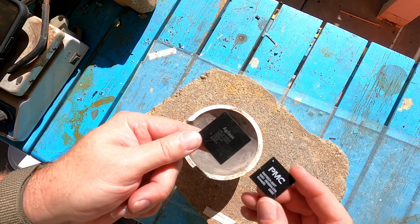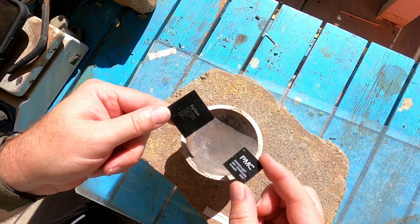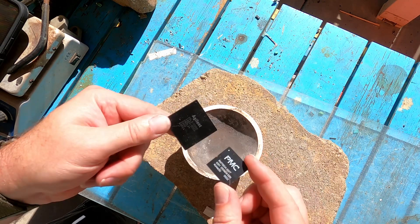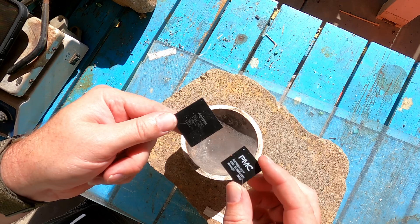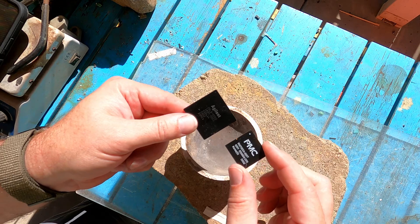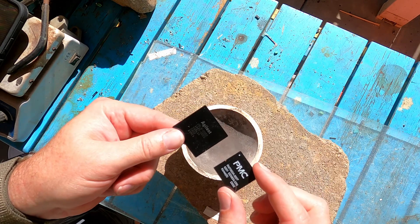What I'm going to do is burn each one of these in my melt dish, then painstakingly use a microscope and tweezers to pull out the individual gold bond wires. I'd like to see if I can recreate getting that 0.014 grams of gold. If I can do that, then I can get a really good estimate when I go to process the rest of my printer boards.